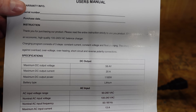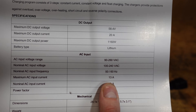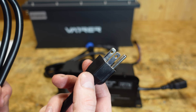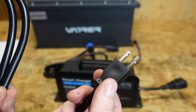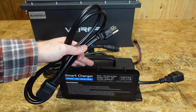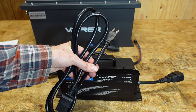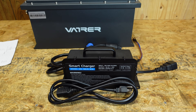Taking a look at the datasheet specifications, we can see it is rated for 13 amps input current. Technically you are exceeding the rating of a 15 amp circuit because a continuous load — defined as three hours or more — needs to be derated 80%. So if you are using this charger, I personally would plug it into a dedicated 20 amp circuit with a 20 amp receptacle. That's just my preference for a bit of added safety.